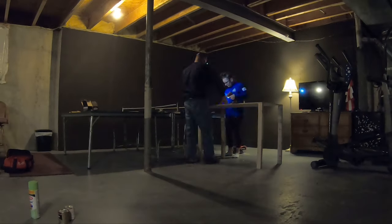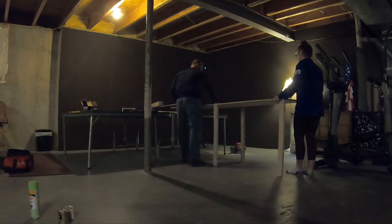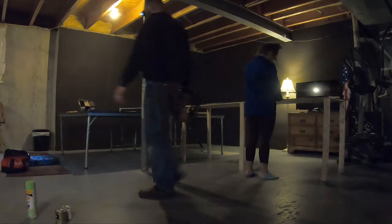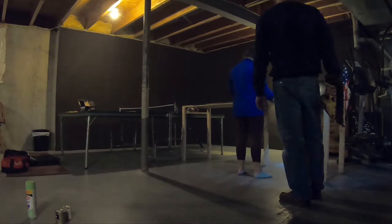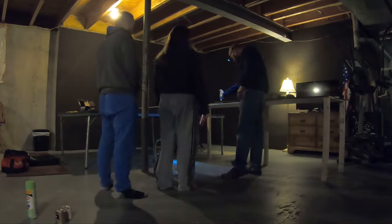From there, we added the second piece of plywood by balancing both plywood pieces half and half on the second legs of the table. Once the second legs were secured to both pieces of plywood, we scooted the table off of the support of the ping pong table and balanced the last set of legs underneath the plywood and secured it. From there, we would use wood glue to attach the decorative trim to the table and a nail gun